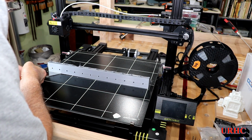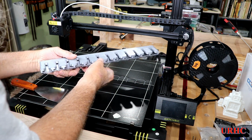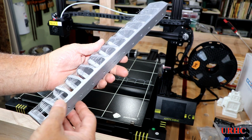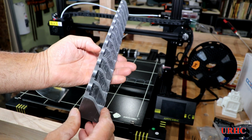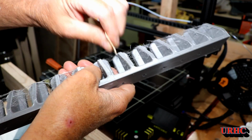But I don't think there's anything there that matters. Once I put some zero backlash nuts on that Z-axis, I think this will be running really good, and I just need to figure out the best temperature and settings for the retraction to get rid of this stringing, because this stuff is a pretty gooey PLA. But there you can see I'm real happy with the results, except for the stringing. I've got to remove that, but that doesn't really affect the part once it's gone.